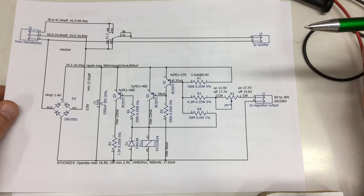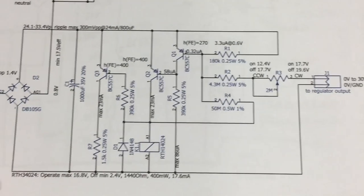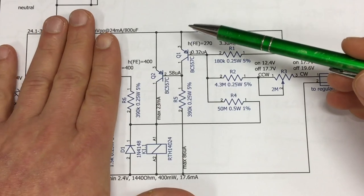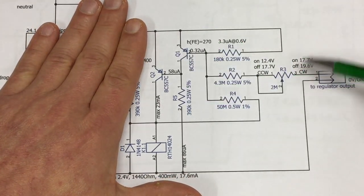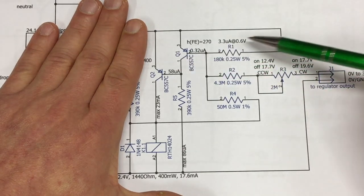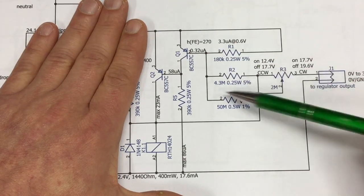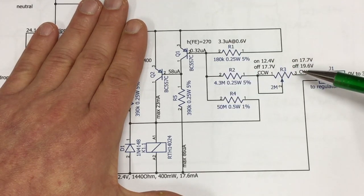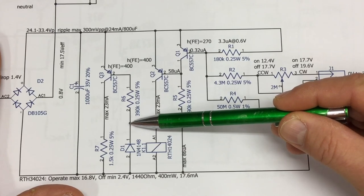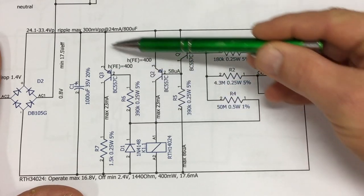So the thing I came up with, and I used the opportunity to draw it. Wait, I'm zooming in a little bit. So basically up to here, it's the circuit we already have: my sense transistor, my driver transistor, and I've drawn the resistors to the base of our sense transistor as a proper voltage adder, averager. That's basically the same. But then we can take this point here, which goes high-low, high-low, and put it again through a PNP transistor.